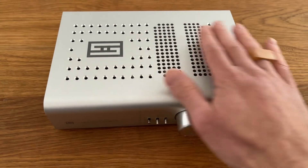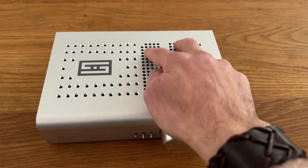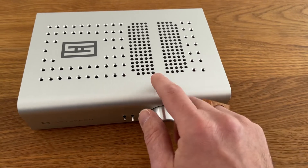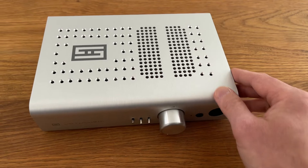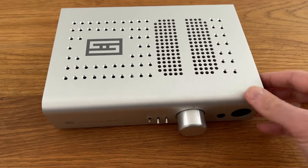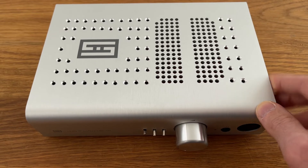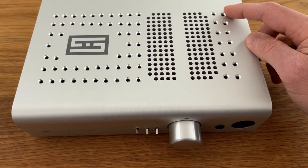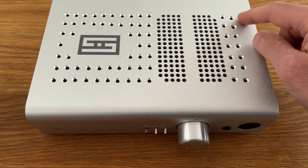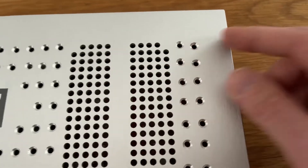Even with copper heatsinks installed, the biggest problem over time is that the casing needs to ventilate. By factory design, holes were only on one part of the amplifier. I found it pretty easy to take off the cover — safety first, unplug the power — and then I drilled some holes. As you can see with sharp eyes, one hole is not perfectly aligned because my drill bit wandered off a bit.